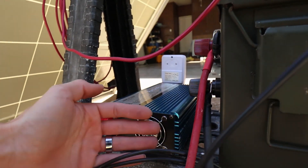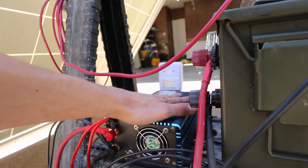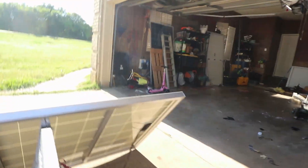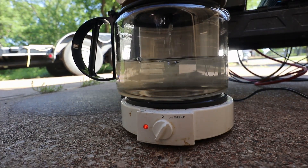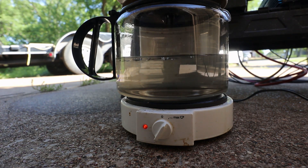That's enough to recharge that battery after a pot of coffee. The inverter's fan is blowing — it's doing what it's supposed to do, getting warm because it's running close to its capacity, and that's okay. One of the reasons I picked this inverter is its high-voltage cutout at 16 volts. Most inverters are in the 15 to 15.5-volt range, and if the battery ever charges above that level, you'll get an alarm and the inverter will shut down.